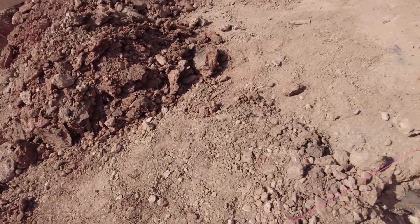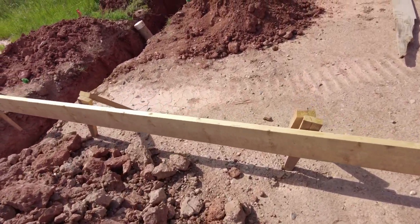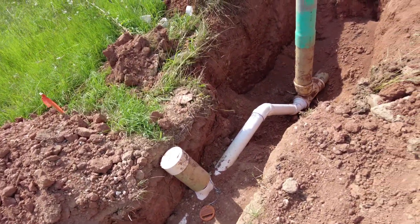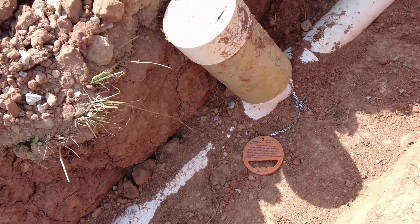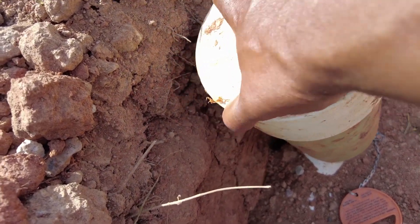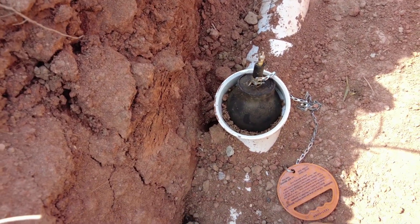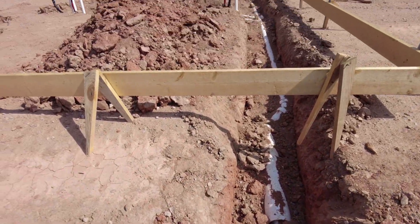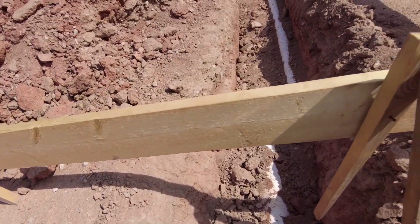Let's go take a look at the sewer connection. This is a pretty small lot, so there's really not a lot to look at on the main level — only three or four plumbing fixtures. That's the sewer connection right there that goes out to the street. My test plug is in here — yep, there it is. You pop that in there and fill the whole drainage system up with water, then check every joint and every elbow to make sure there are no leaks.